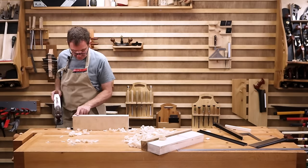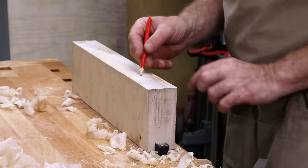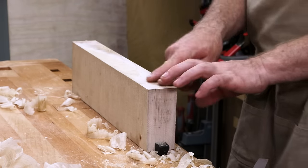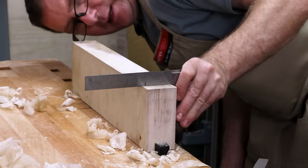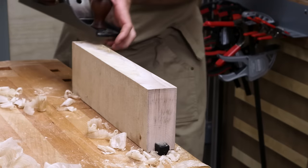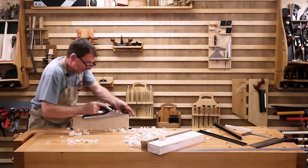On here we're getting no cut. Don't know if we can see that on the camera. Let's have a quick, yeah, got that there. Now on here we've got like a colour. Still got a drop, so the board actually got a hollow coming into the centre. I'm cutting either end here, getting a flat. Start to check what's happening here now. If anything, I've overcut the side nearest me. I've tilted a bit. Now let's take a bit off the far side. So now I've angled the plane. So we're not square. We're deliberately aiming for that back edge.